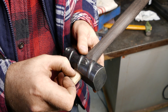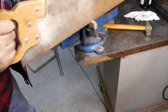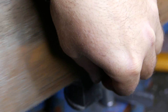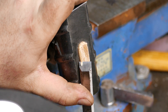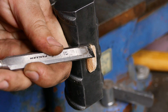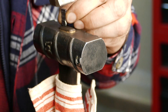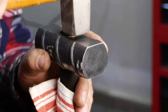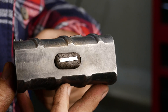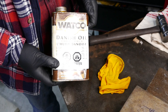Let's cut the excess — we'll leave about a quarter inch and then drive our wedges in. Final touch: a couple of steel wedges. Two-pound sledge! Final stage — we're going to put some Danish oil on it.